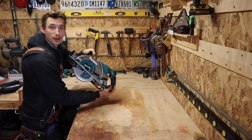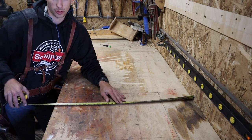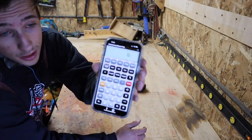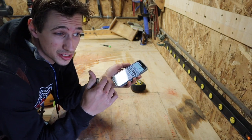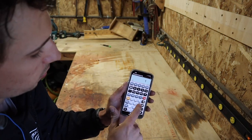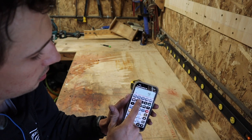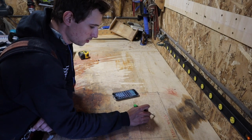I have no idea how this is going to go — I can either be an idiot or a genius. I got a new toy too, we're going to test it out today. So I'm going to figure all of this out using the Construction Master Pro app and just mess with some numbers to see what it gives me in terms of rise, pitch, and stuff. If we do a 6-inch overhang, that brings me to 1 foot 6. So we go 1 foot 6 as our run, and then 10-inch pitch, and that puts my rise at 1 foot 3.